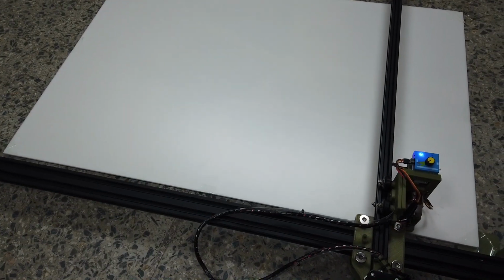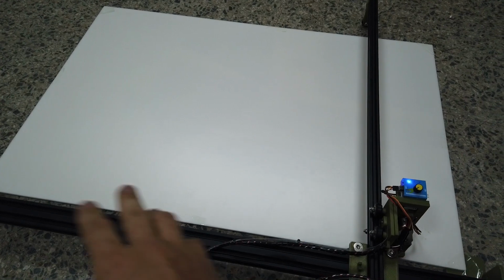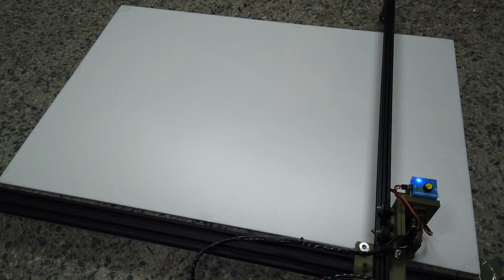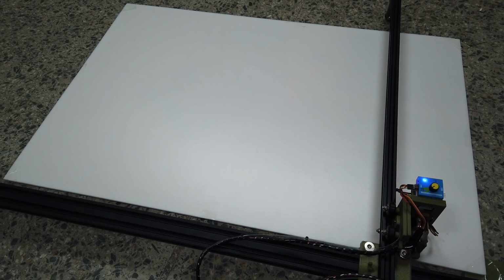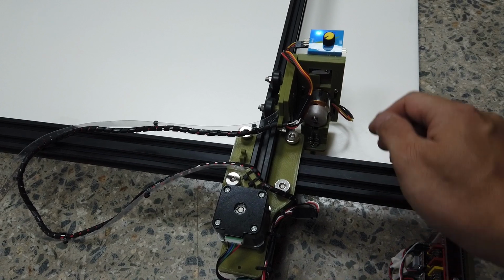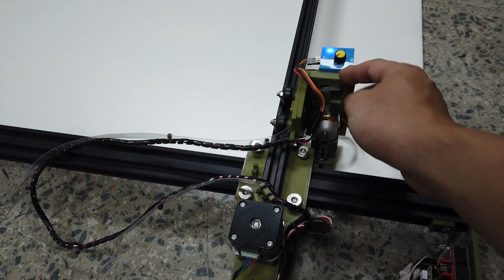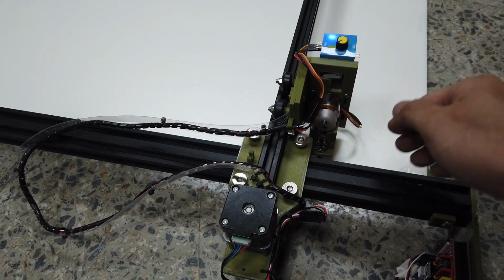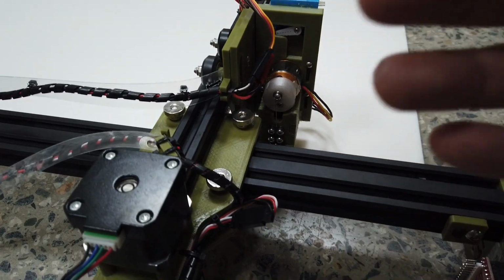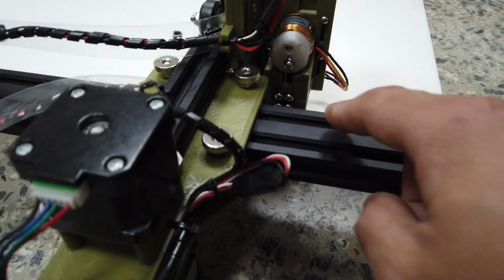Now lay your foam board. In the previous video, I've shown you how to lay the foam board by applying 4 tapes on all 4 corners, and it's 2 layers of 5mm thickness foam board. The bottom foam board will be your baseboard. The top foam board will be the actual board that you want. Now the first thing to do is to verify the cutting depth of the cutter head first. When this goes fully down, does it punch through the first layer or not? You're going to start doing that by pulling your x-axis as close to you as possible, and then move the flywheel to the downstroke position.